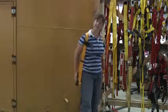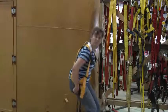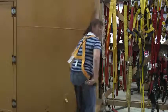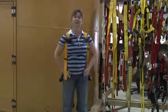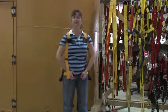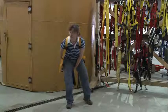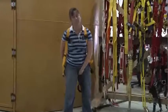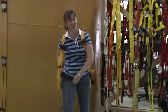What you want to do is make sure that the seat — the lower half — needs to be cupping you, kind of like a chair. You want something you can sit in. This is going to be holding the majority of the weight if you're hanging. You need to make sure it's right up under your butt cheeks, tight and underneath — that's where you want it to be. Next, make sure that the leg straps are tight. We're not talking about cutting off circulation — we're talking about making sure they're going to support your weight and distribute it across the entire body if you do have a fall. Very important factor: make sure that the straps are flat. If they're twisted, it's not going to be friendly. Pull them right up into the joint.